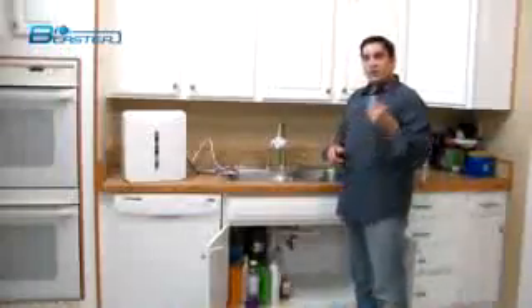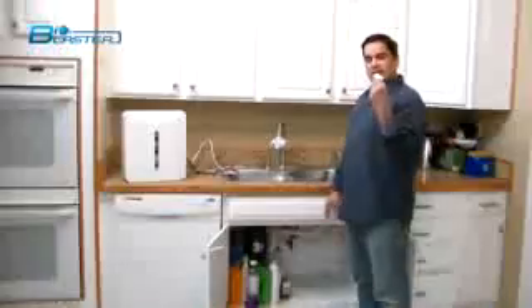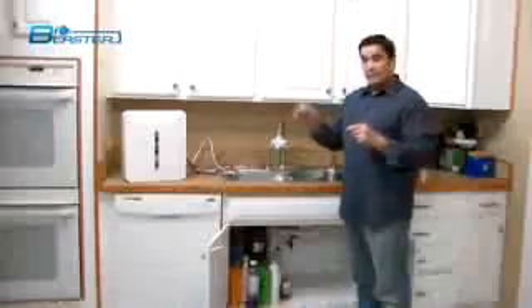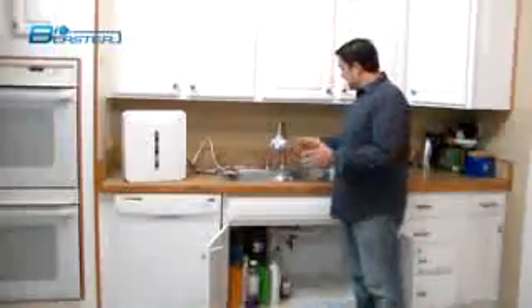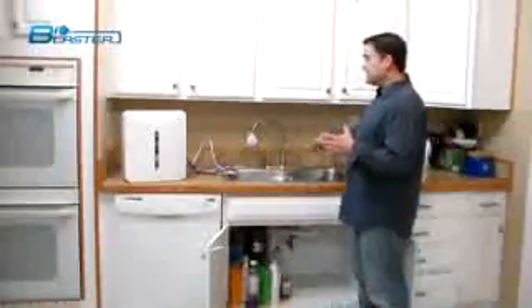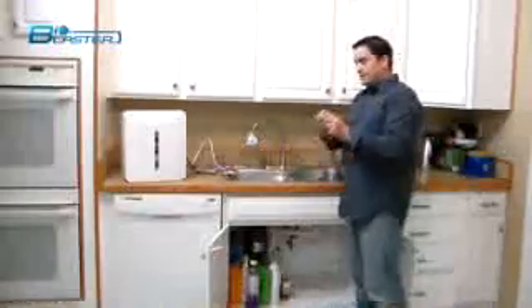The next step is to shut off the water to these sinks. We're going to be installing a valve underneath the countertop that gets us water to and from our filter system. We have disconnected the water — both faucets are in the on position and there's no water coming out. It's a good idea to have a pan or bucket handy when you disconnect the water under the sink, because there'll be a small amount of water trapped in the supply lines.